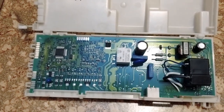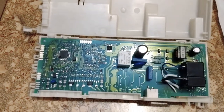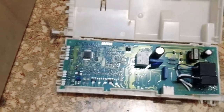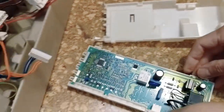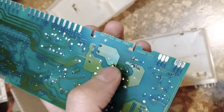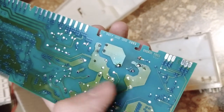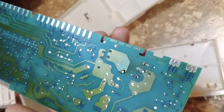There were two white relays — this is the other one, and they're identical. What I noticed after diagnosing that the heater didn't seem to be getting power but seemed to be fine — let me pull out the PCB — was two things. One, it's a little subtle and I've done some soldering work since, but the PCB on the back side is a little bit blackened and the green coating on the PCB is a little bit discolored.